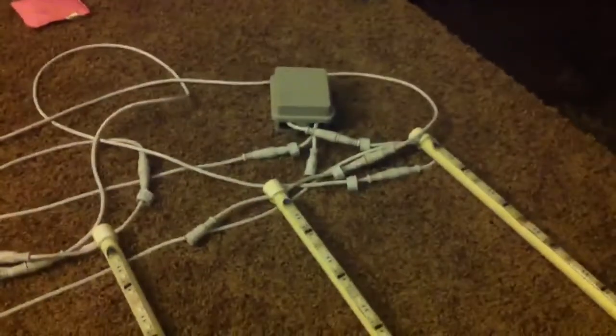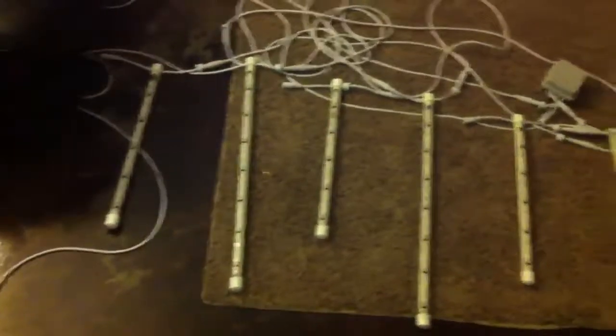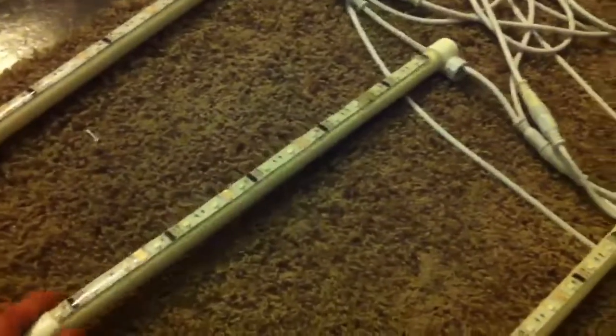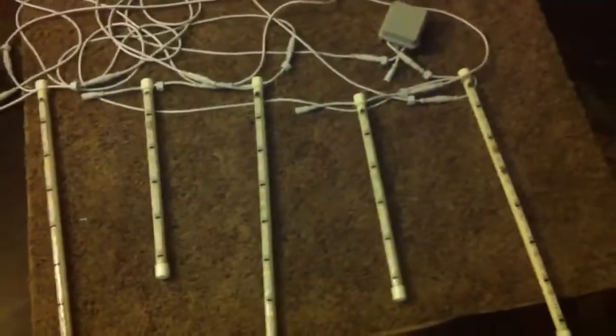These all run off just that one little protocol converter, and I'm using 27 channels. I can add as many to this as I want. What I'm doing is running three sets of seven channels and then duplicating them over, because the pixel strip always recognizes the first pixel in the run as channel one. So here you see coming out of the protocol converter, I'm going to my first tube with seven channels in it, and then coming off of that through an extension down to this tube over here — so that means this tube and this tube will run together. With the way I've wired them, I can use any length of extension in between. They can be run close together like you're seeing here, or 25 feet apart if I wanted.